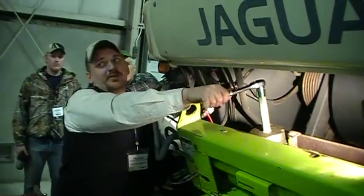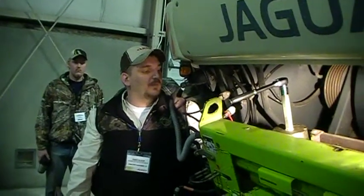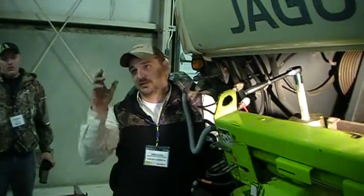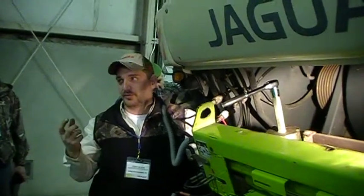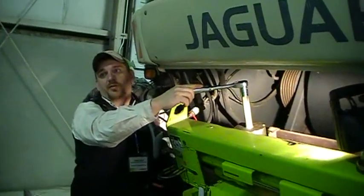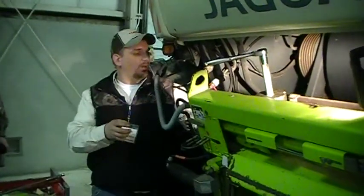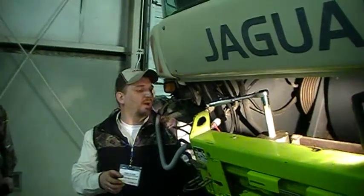You run that down, and you're going to torque that to 125. Once it's torqued and in place, make sure you release the lock. Take that pin back out and turn it, because the first time it goes over and tries to ratchet, if it's held in place, it's going to break the little pin. If you get it all torqued down and you're still too close, once you pull that pin you can fudge the whole holder to set it close, to where it's at the knife, just by turning it. Then reinstall your lock tab and lock that in place. That'll keep it from backing off.